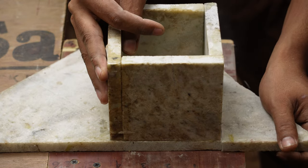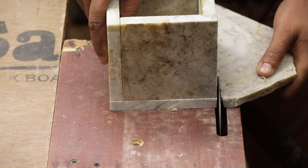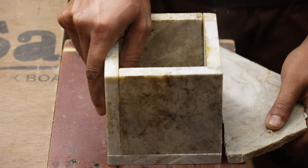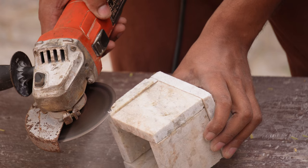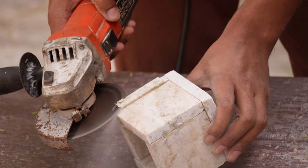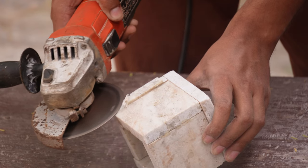I tried to be as quick as possible but avoided cutting my main piece. I know it looks rough, but I'll take care of it in the next step. I attached the diamond blade to my smaller angle grinder and smoothed those extra corners. I use this grinder more often because it's manageable with a single hand, and I also use an RPM controller with it.